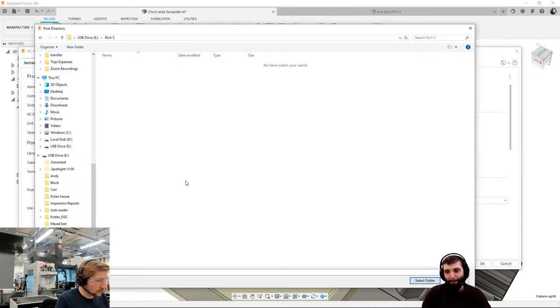The first one everyone's got: it helps centre the tap as it goes in, rather than the tap hitting an edge and struggling. Depending on the type of tap you've got in there, the flutes could slightly catch and pull themselves off. We've got a fairly generous lead in on our taps, so that's not going to happen, but it's good practice.